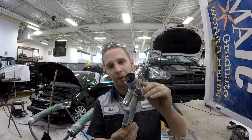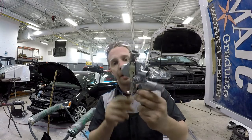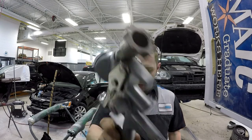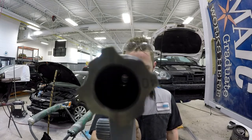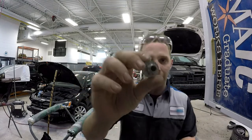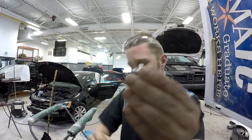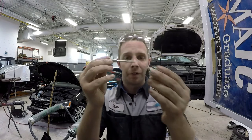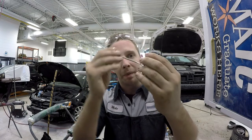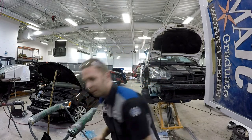Here we have the main body of the gun which is what you generally see me handling. The handle is connected with a little depressor in there that lets air in. I have the fluid tip taken off which you can see right through now. The paint comes in right through there and then out to the fluid tip which is this guy right here. This little thing is called your fluid tip. The paint needle sits inside of the tip, and when you pull the trigger it pulls this needle back allowing fluid to come in around the needle, go out that little passage, and out the front of the spray gun through the air cap.